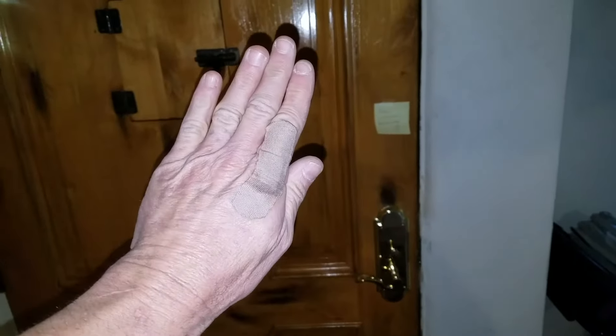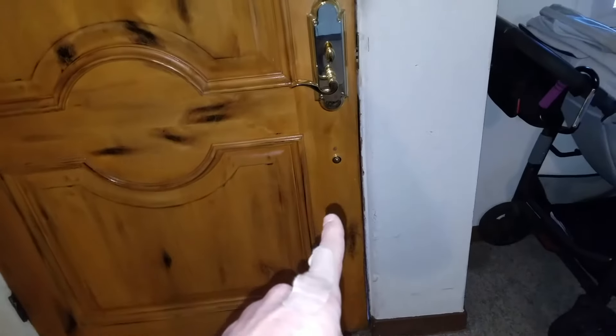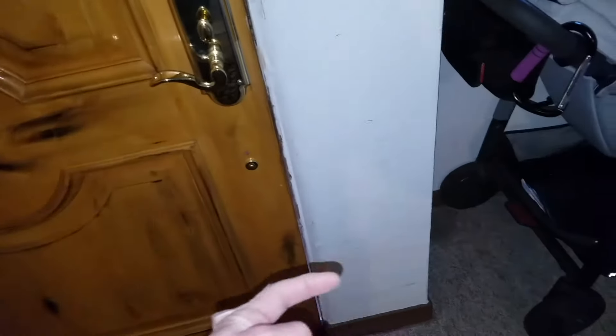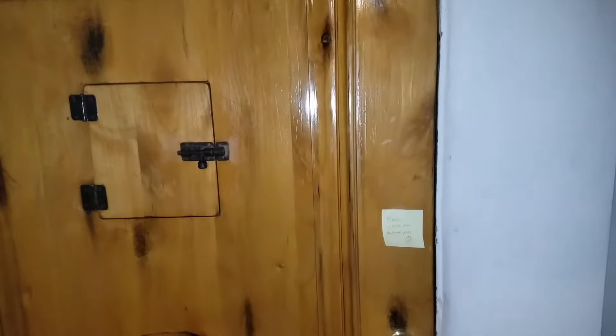Think about it. If we could take the door and kick it out like that, it would raise this lower corner. This side would go that way, and we have the gap to do that. The top side would also go up, and we have the gap to do that. So I would loosen the screws on the middle hinge and the bottom hinge and then put a shim behind that hinge. That will kick the door over and raise this up, and we'll see if that solves it.